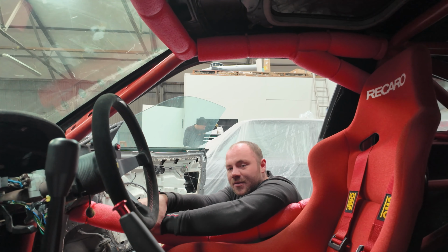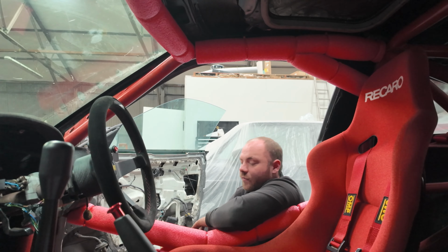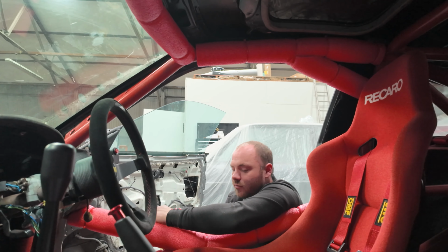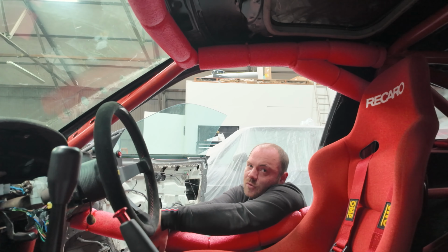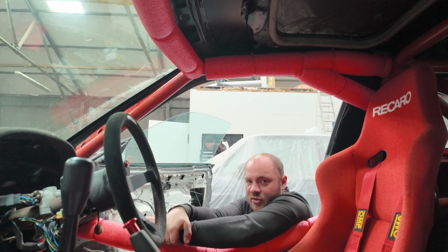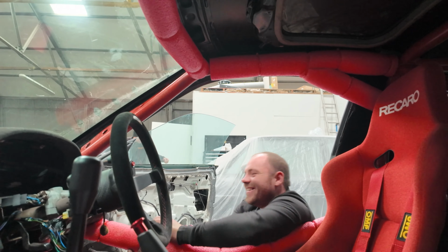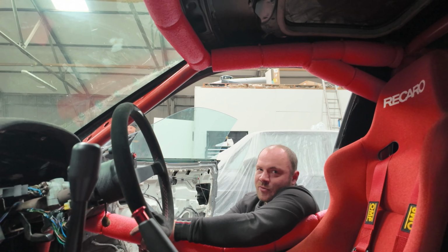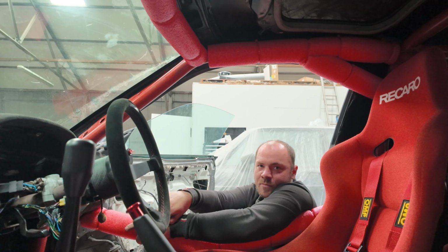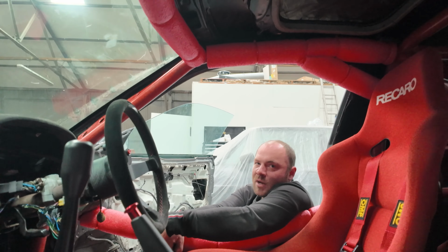And when I left, you were having a problem with the sensor. Yeah, the crank sensor, but we figured that out yesterday. So the position sensor for the crank was wrong. What, the sensor was wrong, or it was this flex plate? The location of the flex plate made us believe that the sensor was faulty, which it wasn't, but then we buggered about with it and fried it. So we put one of Jonathan's sensors on it, we couldn't get it working, and then we literally just stuck the sensor in the hole and held it there and cranked the engine over, and it picked up. So it was a position error with the sensor that was the problem. A physical position error, mounting.